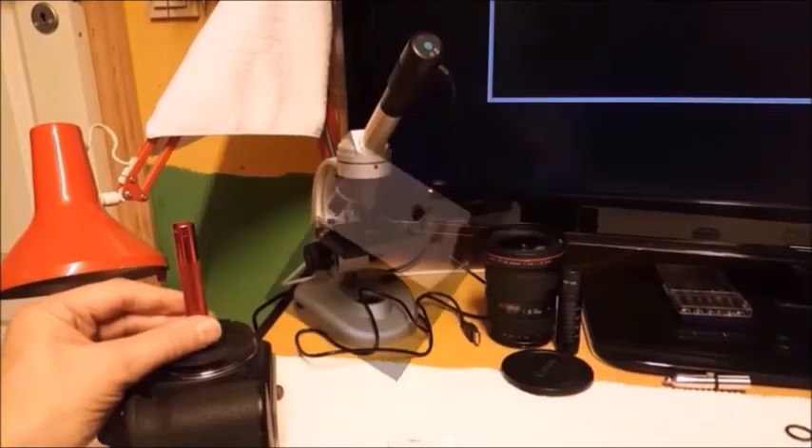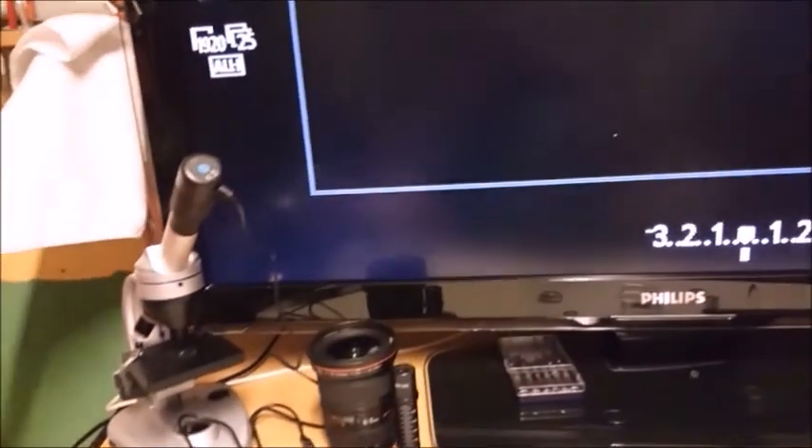When using a pinhole collimator with two pinhole elements, the diameter of the light ray is approximately the same as the pinhole diameter. This setup allows for just a slight movement of the light source. Next to the moving light ray, you can also see a few damaged pixels on this camera's image sensor.